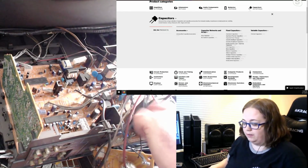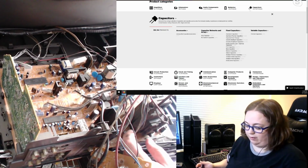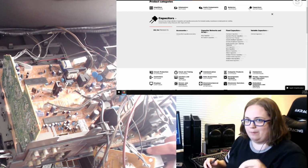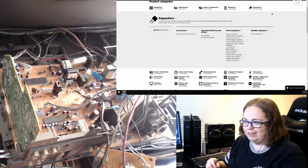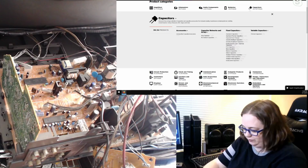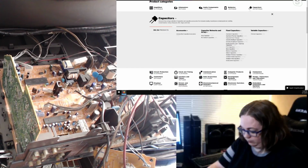The problem is the way this is... Yeah, that's got to be C521. I know for me, on a lot of the stuff with a lot of capacitors, I exchange them as soon as I desolder one, and then I just take the next one and solder it in. That's exactly what I do, and I also mark them all with a marker, so that if something's got a magic marker on it, it hasn't been swapped yet.